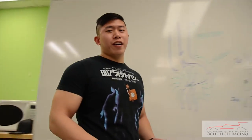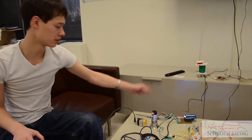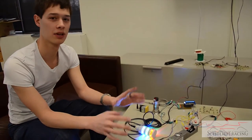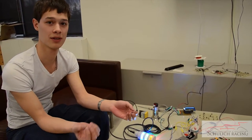For the electrical system, we got Landell Controls to sponsor us with a light tower, a proximity sensor, as well as a pressure sensor. We also purchased from them a T-Guard, which is an industrial grade interlock that will make sure nobody is able to open the autoclave when it's pressurized. In addition, we designed a separate circuit which allows us to interface with our Arduino microcontroller, read our thermocouple, control the lights on our autoclave, as well as control the heating coils and fans. We also designed another circuit which incorporates all of the Landell Controls safety equipment, ensuring we do not compromise the safety rating of the devices.